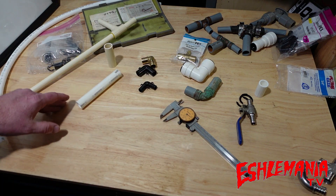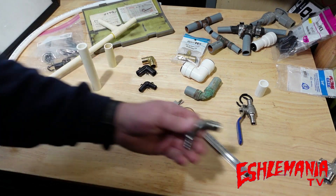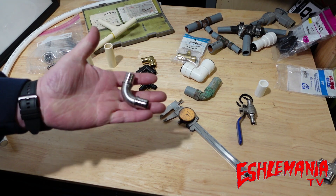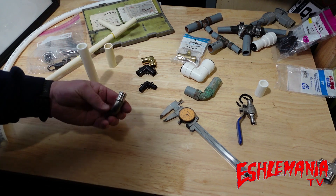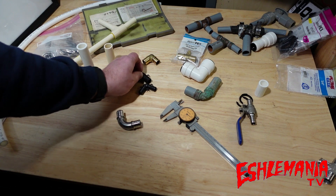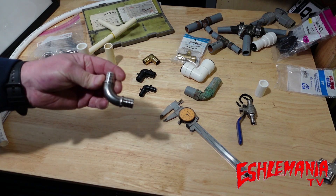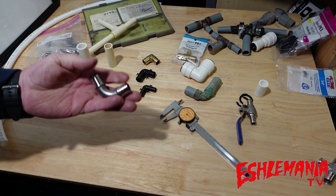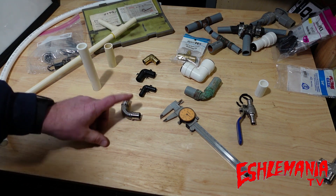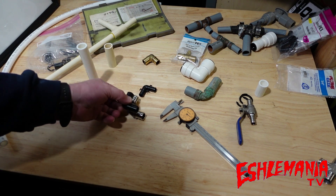If you're asking whether there's anything else you can use — in some areas, if you're lucky, you can find fittings from a company called Plumeys: 304 stainless steel connectors. These have the same inside diameter as the brass fittings, so they flow better than plastic, but being 304 stainless they won't corrode. That's food-grade stainless steel — it won't corrode and won't leach anything into the water.